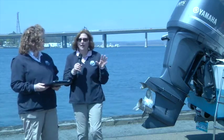Before we get off the subject of flooding and sinking, I just wanted to mention, every year in the springtime, we get accidents where the boat floods and sinks. It may even lead to fatalities. We have had that situation several times. So we really want to remind people that when you're checking the hoses, anytime there's water coming into your boat, you really need to check to make sure that those hoses are in good shape and that they're double sealed. So please, that's an important component.